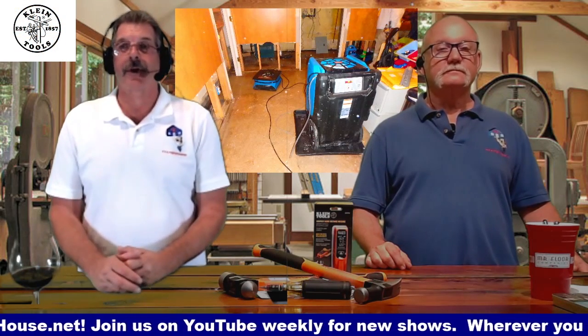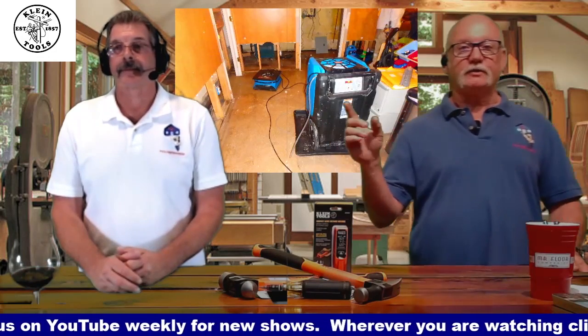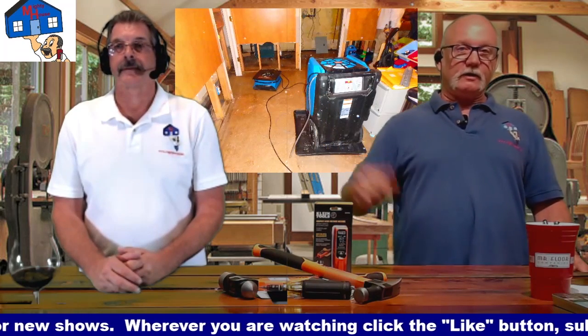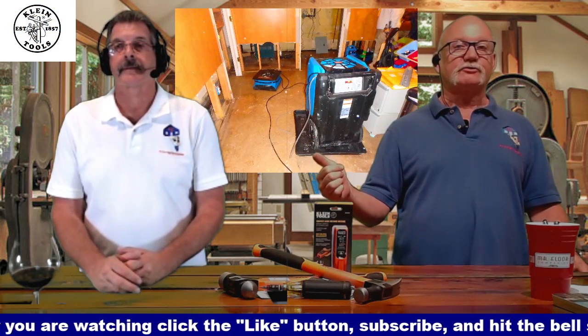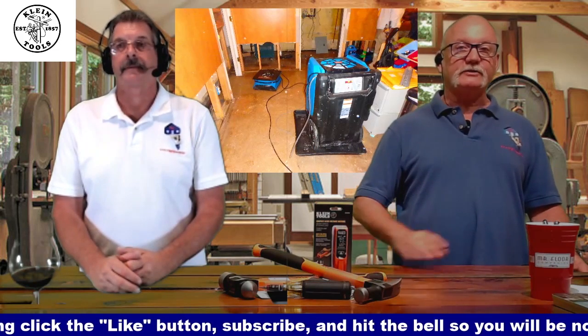Typically, we'll pull the baseboards off and drill holes between the studs. And then they actually have these blowers that have small tubes that'll blow air through there. The other thing you can use is the fiberglass drywall, so it doesn't have paper in it. So we do steel stud, then you do the fiberglass drywall, and then we'll use a PVC baseboard too. And then epoxy coat the floor.